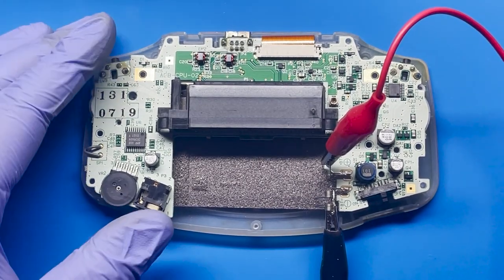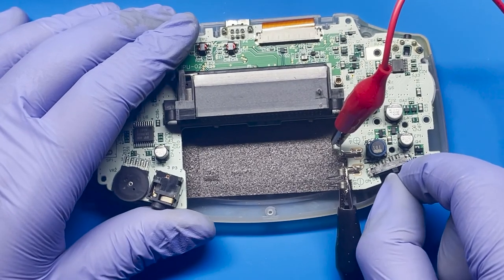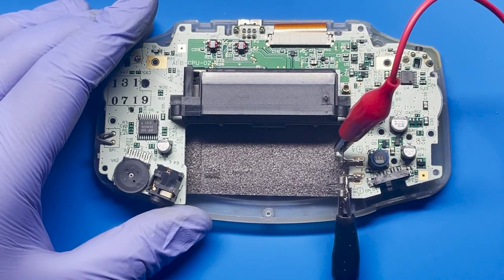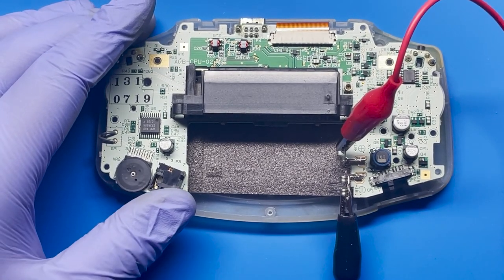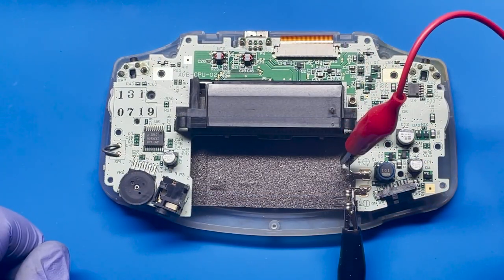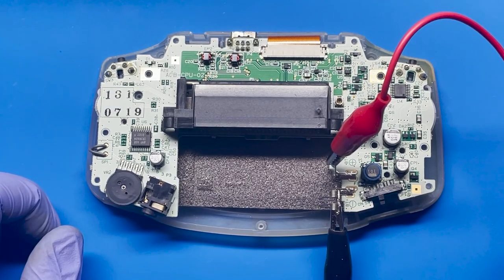Hopefully these little things help for anyone out there who is a beginner or just trying to get this cleaned out. If you don't have the tools, one of the easiest things you can do is put a little bit of IPA onto these switches and give it a good clean — that tends to fix the majority of the problems. For cleaning the terminal contacts, you can use a little bit of white vinegar, or if you don't have that, anything above 91% alcohol should work. I do plan to release a future video once I get the components. Thank you all for watching — if you're new to the channel, please subscribe, and if you liked today's content, hit that like button. I'll catch you all next time.